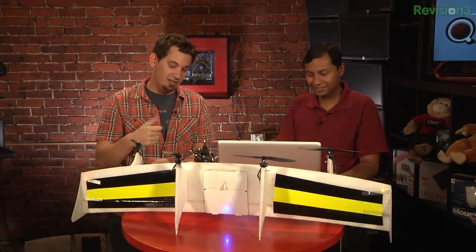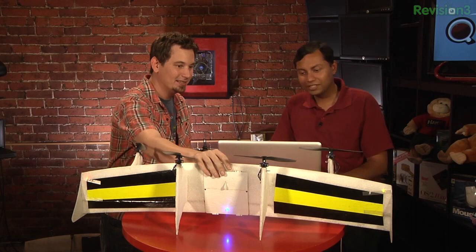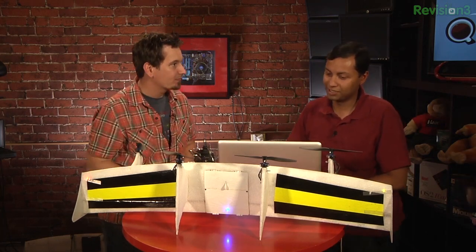I'm super stoked because you're going to show me how to build an airframe. Well, I'm going to show you a little bit of what we did. What's this material? This is actually expanded polypropylene — EPP. It's basically foam. What we've been doing to build our prototypes is taking a block of foam and using a CNC router to cut out the shape which we designed. And hopefully, if things go well on Kickstarter — and they've been going tremendously well thanks to all the support — we should be able to injection mold them, which will give it a nice clean finish.